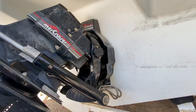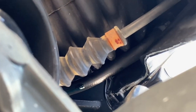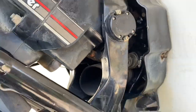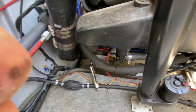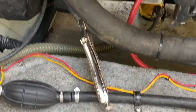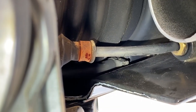Now this thing looks like it's going to be very difficult to change out, and so this is going to be the process on how I get that changed out — you can see it right there — without having to dismantle this whole thing. At least we're going to try. Here's the gear oil reservoir, and it has a line that goes through and back to the outboard. I just use a pair of vice grips to pinch off the line so I don't lose everything in this reservoir when I pull the line. There's the portion that goes into the outdrive.